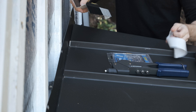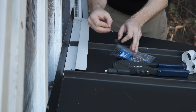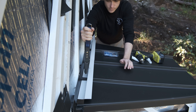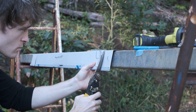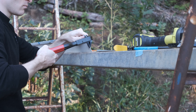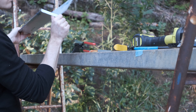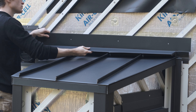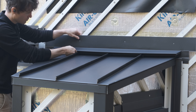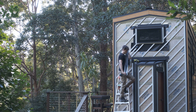At the back of this roof I need to install flashings that will stop water from entering the structure at the joint to the wall. These Z flashings provide a place for another flashing to clip into at the wall joint. Under the Z flashing is some butyl tape to stop the back flow of water, and then I permanently attach them to the roof with rivets. I made a small fold at the corners of this piece to help guide water down, and it then slips over the top of the Z flashings so water can flow down the wall and onto the roof without getting under the back side of the roof panels.